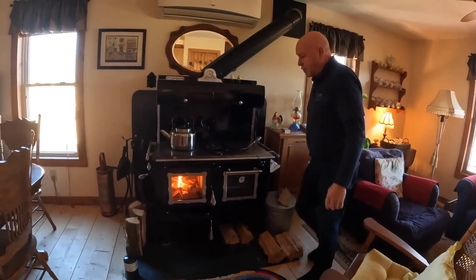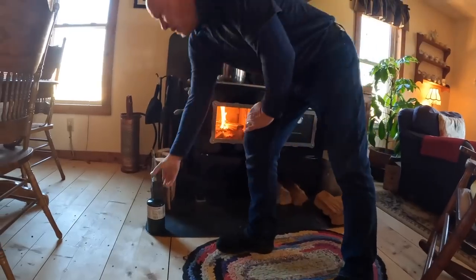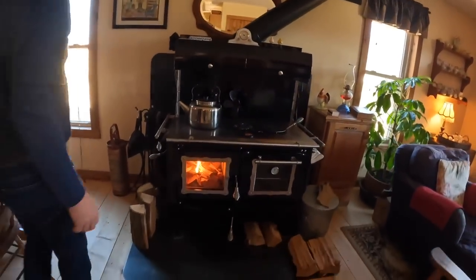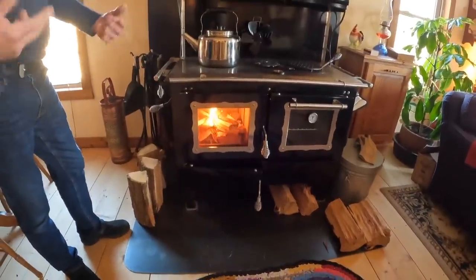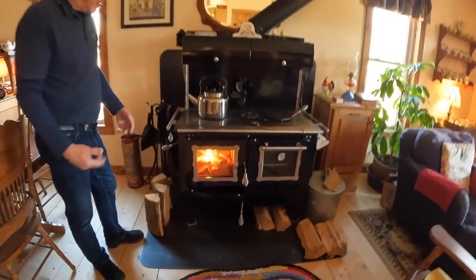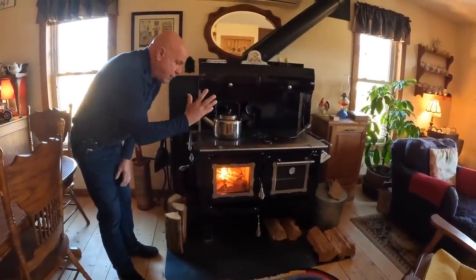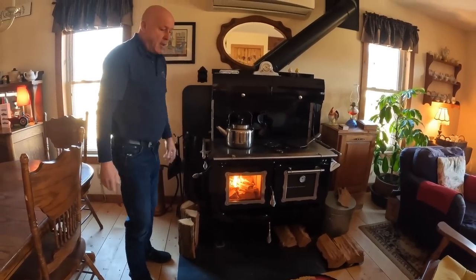Of course, now that I know that the flame is running good and the smoke is going up my flue, I'm just going to give that a little bit of time, and I make sure that my propane torch is out of the way. And notice that we've still got the box open at the bottom, letting it burn through. It takes a little while. You can't rush a wood burning fire. You just got to let it do its thing. I'll eventually be closing the ash door, and that will cause more draft. And I'm making sure that my flue is still open, and I'll be closing that.